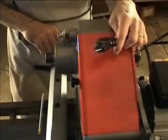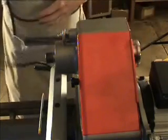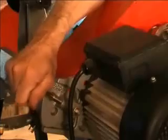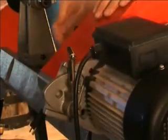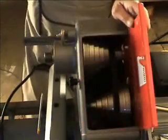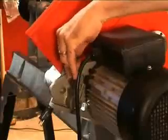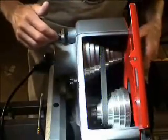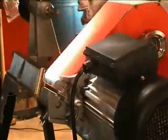It never hurts to unplug your lathe during a belt change or any time you're doing maintenance work. So with it unplugged, we'll first loosen the belt by undoing this cam lock and moving the motor forward like that. We'll open up the belt cover and slip the belt over to the new pulley setting, walking it right up like so. We can now tension the belt and double-check that we've got good alignment — we do. We'll close the cover, lock the cam lock, plug in our lathe, and we're ready to go with the new speed.